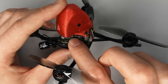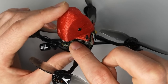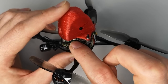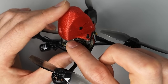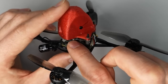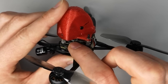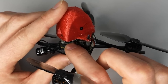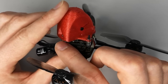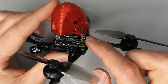One thing that I did notice, and I would advise you guys to be careful of when you're building out a naked Vista, is that these pieces of metal that have the flex connector attached to them come with little stainless steel sponges when it's assembled in the Vista. I would remove those sponges because I had an experience where they actually shorted out on one of the components above the sponge and caused a problem. So the flex connector here, remove the sponges on top of it so that you don't get that problem. You won't get a short, and then you should be able to build everything out just fine and use spacers or nuts to just keep those two boards separated.